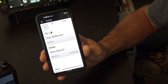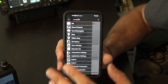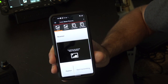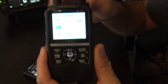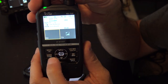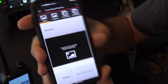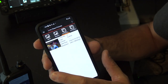Now that the app is connected — it just said 'Pixel connected' on the screen — I can see it already populated with the reflector and Vero Beach, so it's reading my radio. If you click the top left in the app, you'll have all kinds of features. We're going to go into those in another video. For now I'm going to go to picture messaging — share pictures. Right there, I'm in share picture mode. On the ID52 you go into menu and go to picture mode, and you'll see a receive and a transmit box. The same on the app — receive and transmit history.